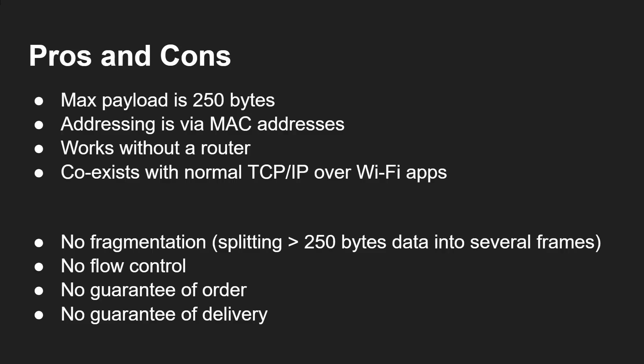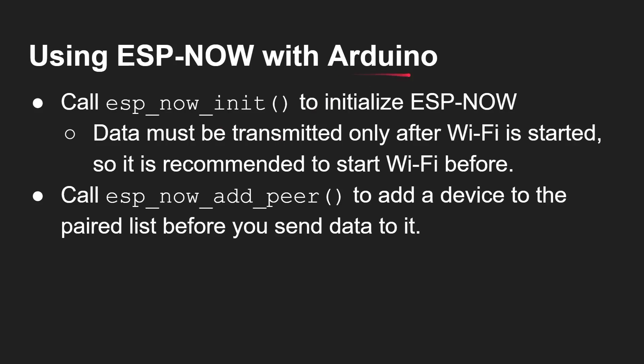The very low-level Wi-Fi stuff is taken care of in those first two layers, but anything from a higher networking level is not handled at all. For sending small amounts of data within a certain range — not at very high bandwidth — this is perfect. For example: turning a light on and off, configuring colors in an LED strip, or sending a temperature reading. For smart home applications, 250 bytes in a local area without a Wi-Fi network is perfect.